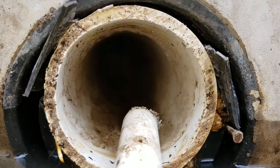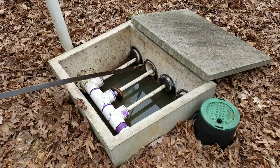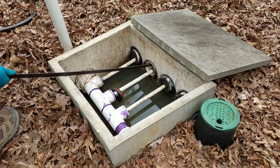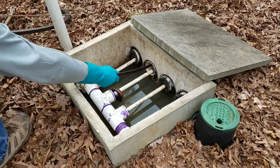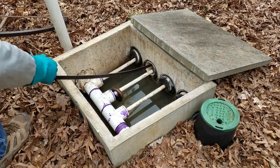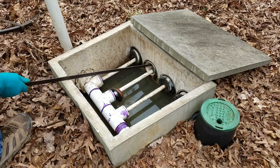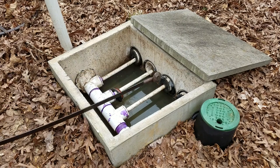At about six feet in, there's a 45-degree fitting and the pipe turns to the left, but it all looks clear up to that point. I couldn't insert the sewer rod flat because I needed it to bend to the left, so it had to be inserted vertical. It would only go in so far in this orientation because the bottom of the rod would bind up on the concrete box, while the top of the rod would bind up on the top of the pipe.